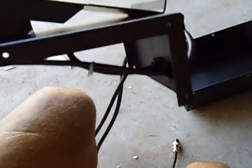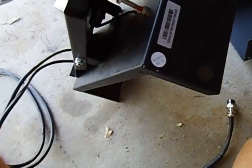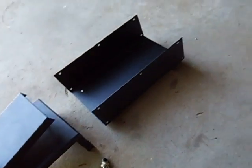I bought this pedal to use on my welding machines. There's a stopper there so you can't travel too far down with the pedal and damage the resistor on the side. So it's just like a slide volume control - it's a 10K slide resistor.